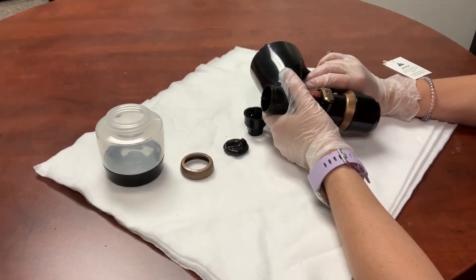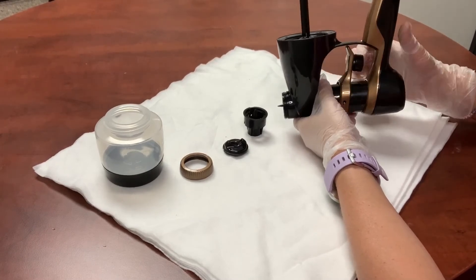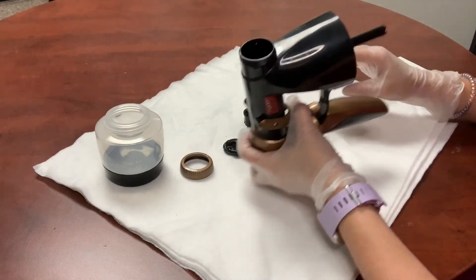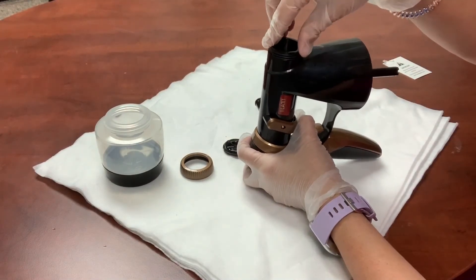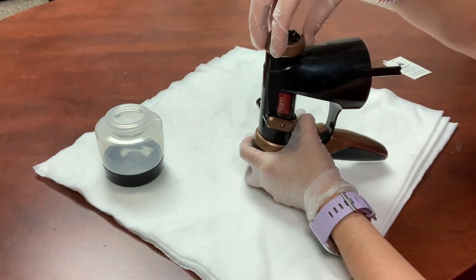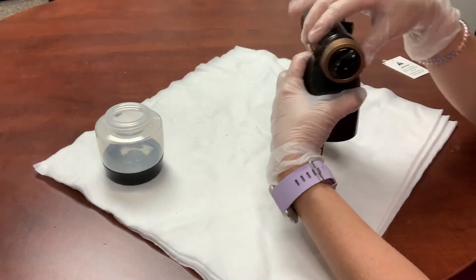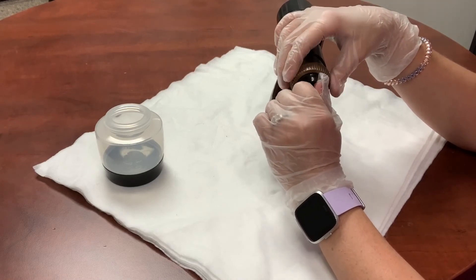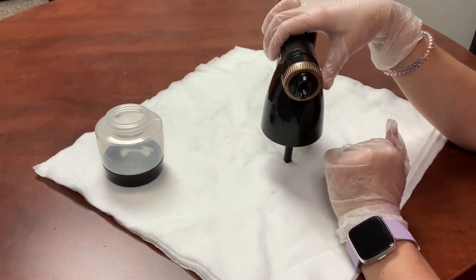When reassembling the gun after the detailed cleaning, make sure it is all the way to the plus symbol and pull the trigger while putting everything back together. Take your nozzle and make sure it goes down into the grooves, then attach your air cap, and then your air cap ring. You can let go of the trigger, straighten up your air cap to vertical, tighten your air cap ring just a small amount, and you are done.